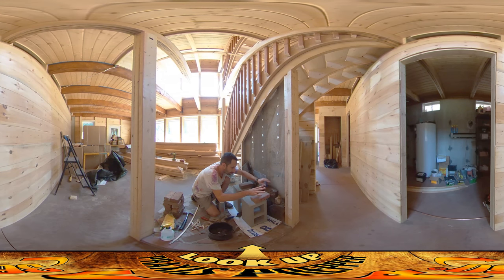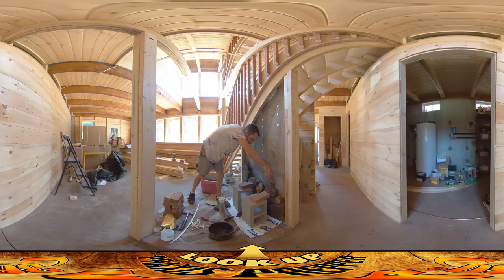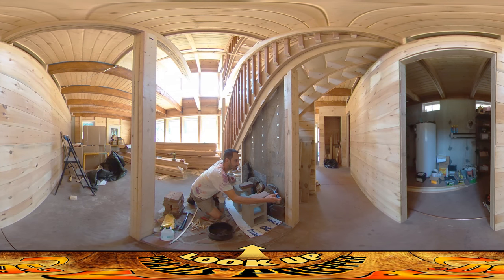I notice that cardboard down here because I was doing some dripping. That's pretty good. Now the last thing I'll do for that stone is get some concrete — not really aiming for the top, mostly back behind it. I want to work some concrete into the back there so this stone is not only attached to the stone below but also to the metal mesh. Same kind of thing — just a jiggle motion — and that gets the concrete to flow right down in here. As long as you get a good grab you should be fine. So that's it, day after day we'll eventually get up to the peak. Thanks for watching.